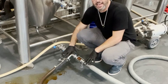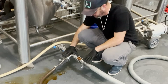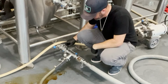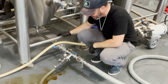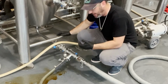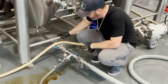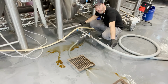This is a block that I use to push no-rinse sanitizer through the heat exchanger and out the lines. And so it's still hooked up, but this tank is closed right here. It's just a clean, sanitary way to get wort into the fermenter without opening anything up, right? You're just creating one consistent line that everything can stay sealed with. And you can see this water starting to steam over here.